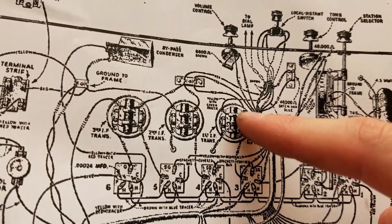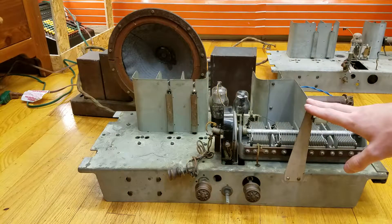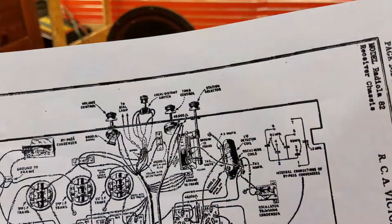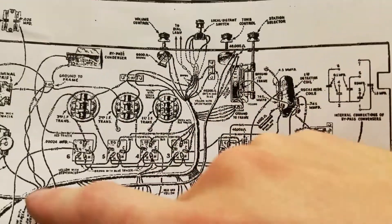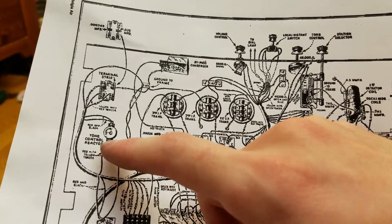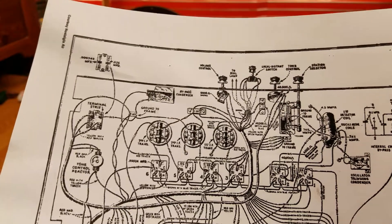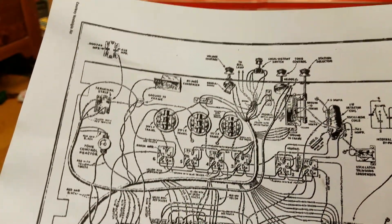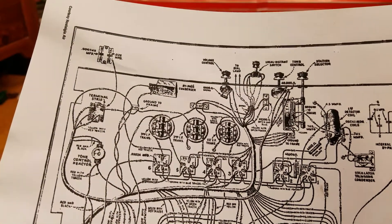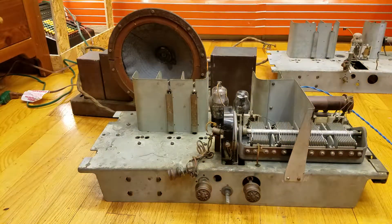You notice that it looks like the copper disc has one flange bent that way and one bent that way. But on the coil that I just showed you, they're straight out the sides. The one that I replaced — the one that's in here now — does have the flanges bent, but they're both bent in the same direction. So again, I have no idea what they're doing. You notice this one has the tone control here — that's that tone coil, or we call it a reactor. Reactor is basically the old word for inductor. The tone control controls how much current flows through here. When the tone control is fully at one extreme, most of the current flows through here and it swamps out, blocking the high frequencies. When the tone control is at the other extreme, this is basically shorted out and you get all of the frequencies. I'll give you a little demonstration, and over the next few months I'll be building a cabinet for this, and perhaps I will show you the steps along the way.